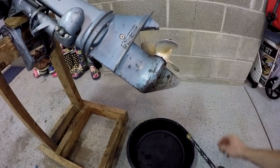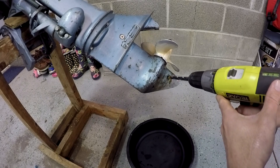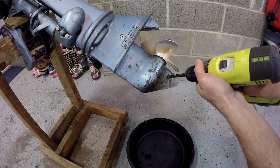I'm going to pull this old plug out with the stripped threads. Next we're going to drill this out. You want to make sure that the drill bit is perfectly perpendicular to the hole, so we're just going to do slow RPM.